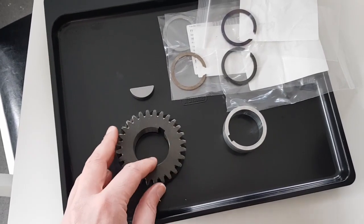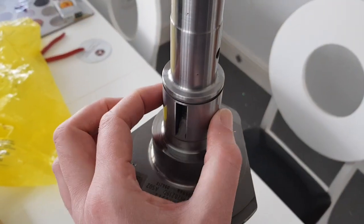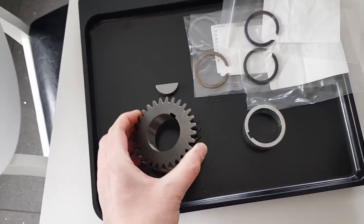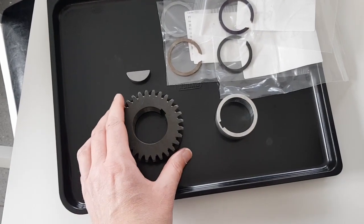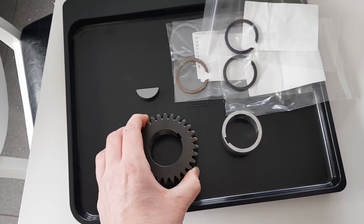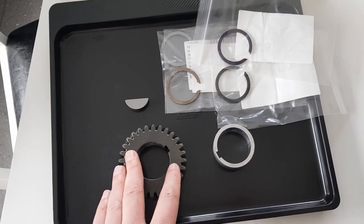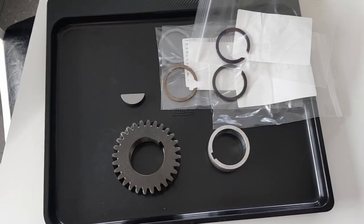I've measured the gear — it's 41.962 mm across the inside — and the shaft measured across here is 41.992 mm, so there's 0.03 mm interference on it. When steel is heated up it expands at a rate of around 0.001% per degree C, and it needs to expand by 0.07% to fit, so I need to heat it up by at least 70 degrees. If I heat it by 70 degrees C above the temperature of the crankshaft then it'll be the same size, so I'm going to heat it up to about 150 degrees C so that it should slot on nicely. I'm going to put the gear and spacer in the oven — circlips don't go in, Woodruff key doesn't go in — and whilst they're heating up I'm going to get the key fitted and check the size.